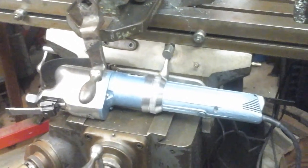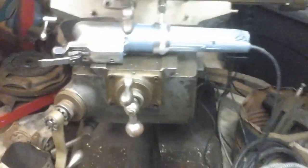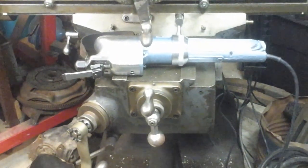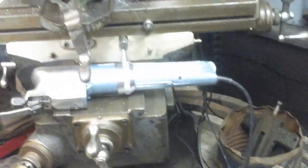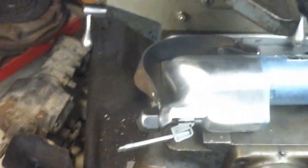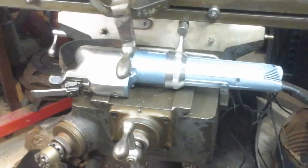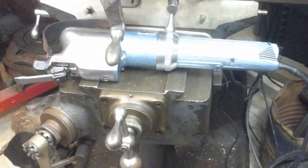When I got it, it was pretty rough looking — the paint was chipped and scratched up, and the bearings in the motor were starting to squeal. So I got in touch with Ed Dijek up north; he's one of the main distributors for these. I was able to find out what parts are still available. I got new brushes and new bearings, and while I had it apart I gave it a new paint job and polished up the nose on it — the paint was already missing there anyway, and that's a spot I'd probably keep wearing off. A lot of the big parts you can't get anymore, but I was actually surprised there's still a fair amount of the smaller parts available. You just have to be careful with them and take care of them.